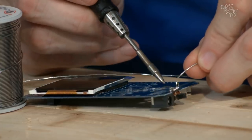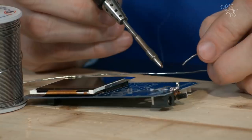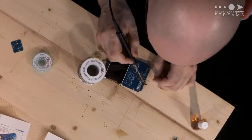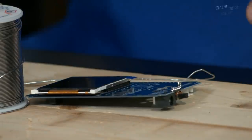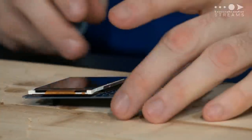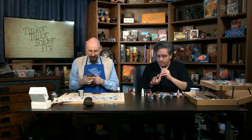Yes, the trick is not having any of the solder touch each other, right? Yes. All the pins have to be isolated from each other. I assume you can count on capillary action to do a lot of that for you? Quite a bit. It's one of my favorite physical phenomena now that I've been doing more soldering. I've seen people talking about it especially for surface mount components. It's quite amazing, the way you put the stuff down and then heat it up and it all moves into the right spot. Ideally, assuming you know what you're doing. Which is why the flux can be so magic.